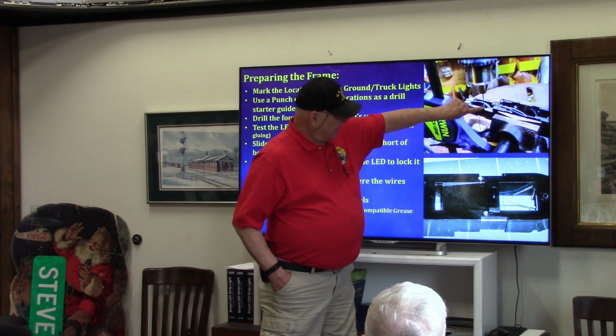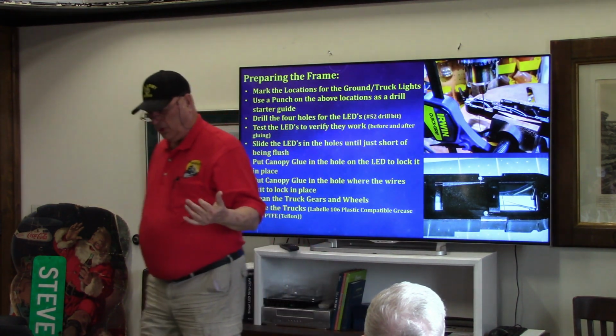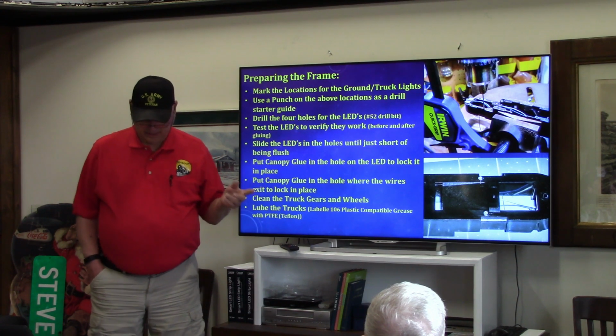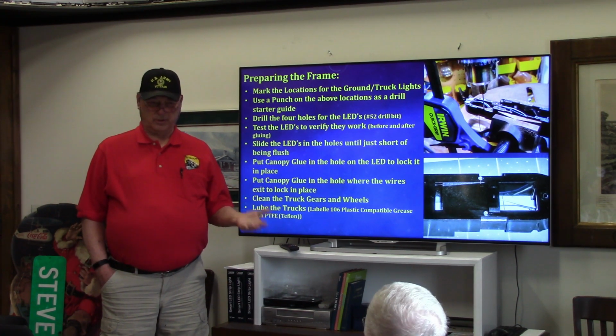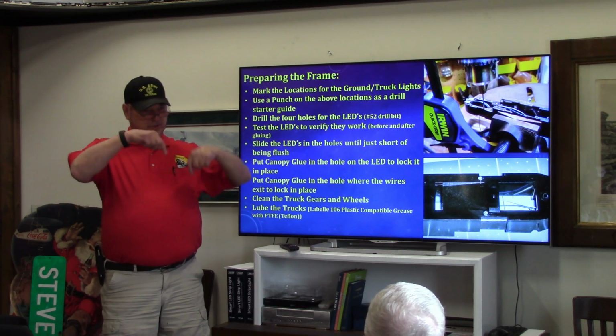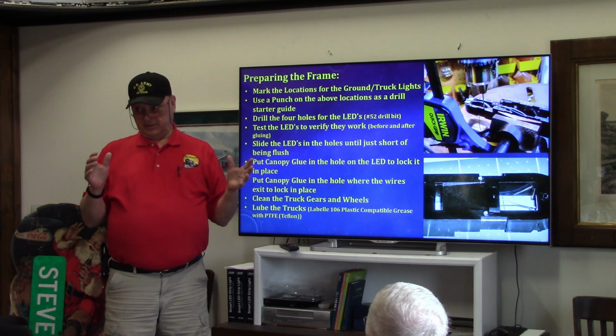And if you notice at the bottom here, the flutes are clogged. I don't know what kind of material the chassis is actually made out of. It's relatively heavy, but it's not typical steel or aluminum, because when you drill those, you'll get the little curly cues coming out of the flutes. This here packed the flutes.